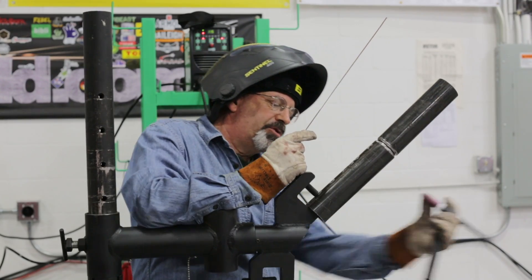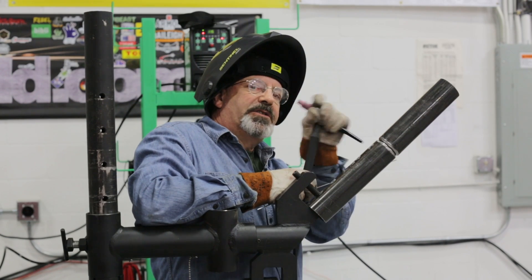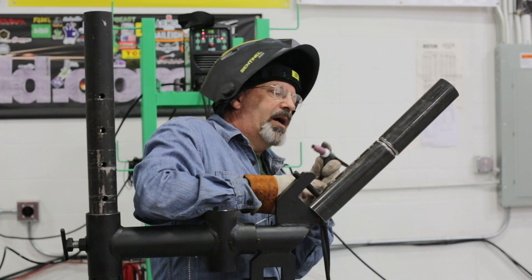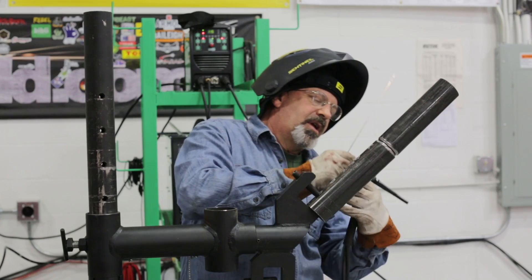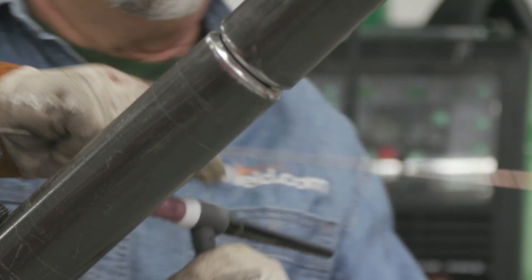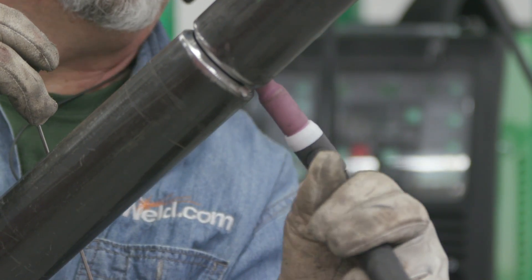A couple of ways to hold the torch. I don't really want to stop on the way up. I can come in here and hold it like this. By the way, this is not a flex neck, so I'm kind of rigid. I don't like that because I like to be able to bend this and get more straight into the pipe. But I could hold it over here like this and come up, or I could put a couple of fingers on here and come up. I've seen a lot of folks do that and do it very well. I've got a number five cup on here, but my gap is just almost not wide enough.